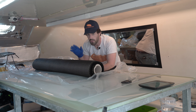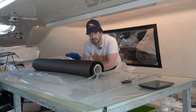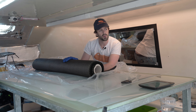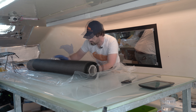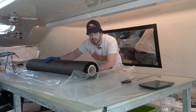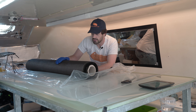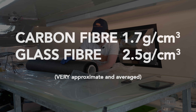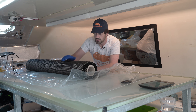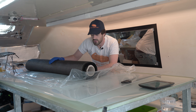What I've decided to do with this one is a carbon fibre and glass layup. The reason being I want a little bit of extra stiffness from the carbon and a little bit of extra tensile strength, because there may well be some areas where you might want to stand on this part of the cowling. I'm going to sandwich together the carbon fibre and the glass fibre so we get a combination of the two characteristics. You may be asking why carbon - the answer is because this was extremely good value. This is 1200 GSM, and if you look at the characteristics of carbon versus glass and take weight into account, bearing in mind I might want to remove this lid and move it around, you do get the best combination of strength and lightness from this fabric. It's not a bank-buster as I managed to get a really good deal on this really thick heavy-duty carbon fibre.